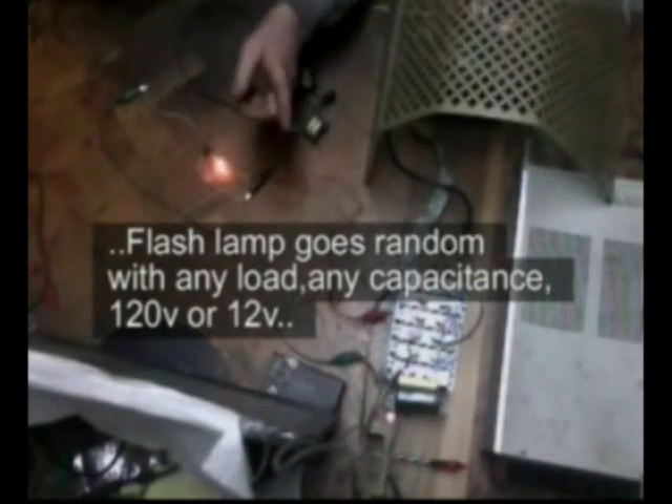My flash lamp — I haven't figured it out. I've added a 250 pF cap and a 50 pF cap on the ends, in line with this, hoping to knock out any high frequencies. There it goes again. That's what I haven't figured out yet. This is operating at about 10 pulses a second, but still these caps get overloaded somewhere in between the pulses. It fills up so fast it doesn't empty, and it comes out here.